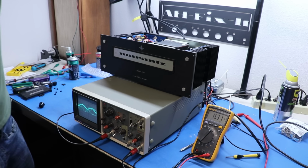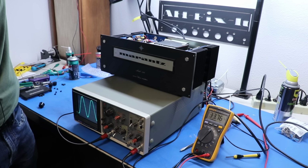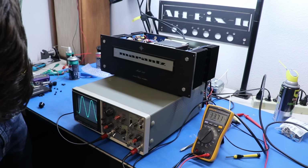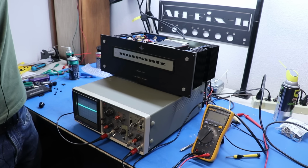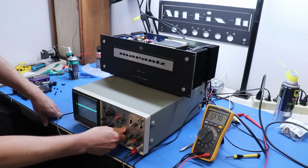That was on the minus 20 dB button, so let's bring it way up. And let's see how... there's clipping right there, so bring that down. 33.42 volts. What does that convert to? 33.42 volts into 8 ohms is 139.6 watts. Not bad. Let's do those one by one.